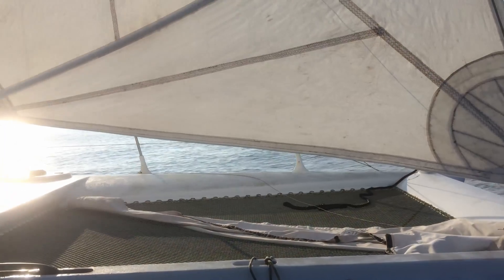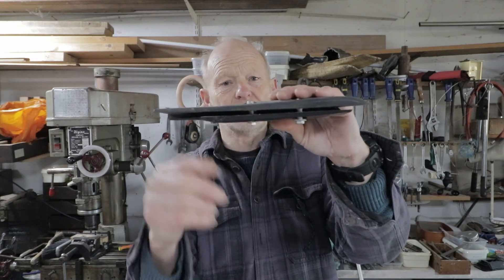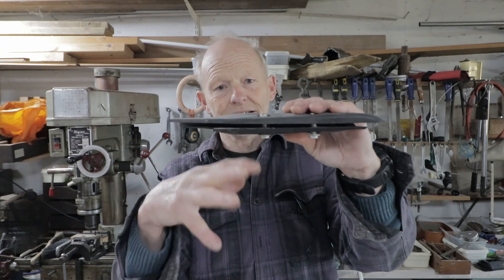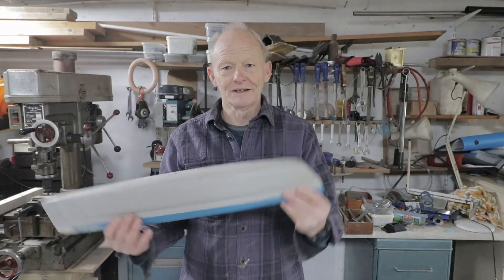We found that motoring in rough water when the wind dropped wasn't efficient — rpm going up and down constantly, losing forward thrust. That made me think about cupping the propellers. In Cornwall I met a propulsion expert — a guy into propellers and zap cats, which operate in a lot of aerated water. His advice was to take the hydrofoils off, as they were probably trapping air and creating ventilation on the propeller, and to go for a cupped propeller.